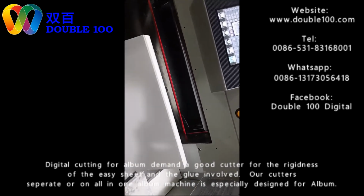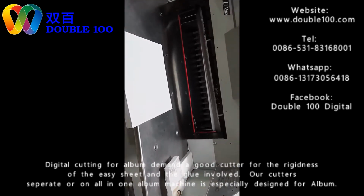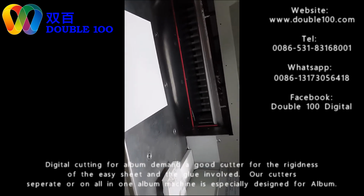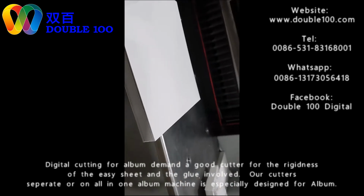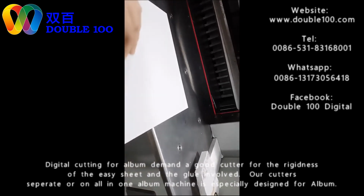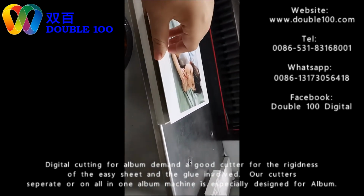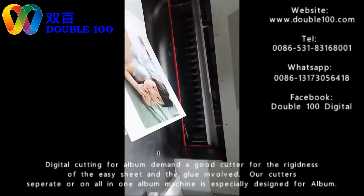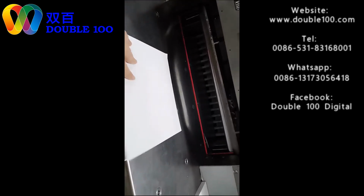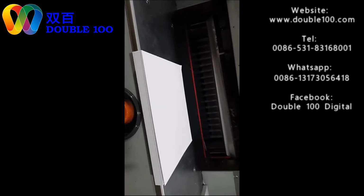The electric cutter, the cost may be lower. But around 50 to 100 books per day is enough with our electric cutter. Also, for the cheap cutters, I don't advocate them for PVC books, because PVC is plastic, very hard, and also with glue. So I don't advocate the cheap electric cutter for papers. If you want a cutter for albums, please follow my advice: use a good electric cutter or hydraulic cutter. You can come to us to get the best recommendation according to your working capability.